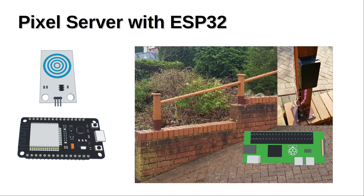You may be familiar with capacitive touch as it relates to the screen on a mobile phone — it's the same concept, but here we're using something much simpler: a Velleman VMA305 capacitive touch sensor switch. The pad acts as a capacitor surrounded by air. An oscillating signal is applied to the capacitor, generating an electrostatic field. When you bring your finger close to the plate, it changes the capacitive value and the frequency of the oscillations. In the Velleman switch, this is converted to an analog voltage that increases when your finger is near.